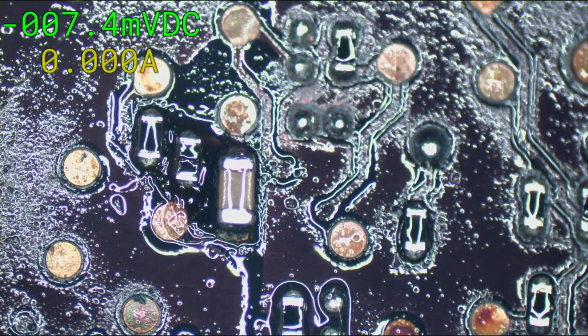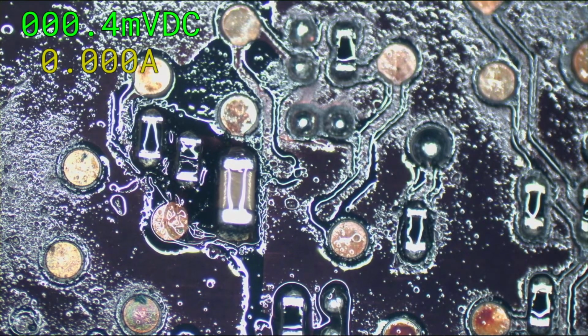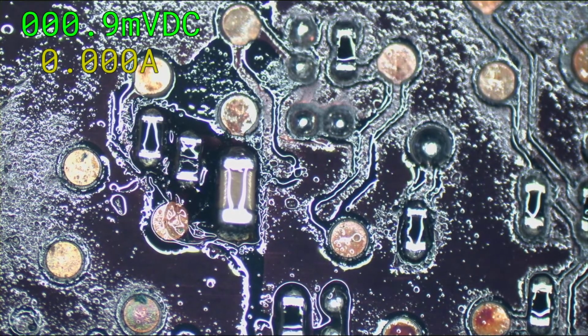That is this one. Now this is one good thing about Lewis and his flux usage. So I'm taking this off of this board. This is a donor board that I'm taking it off of. And there's so much flux on this board that this resistor that I'm taking off is dry, completely dry. But once it comes off the board, I'm going to dip it into a pool of flux that's on this board, and I will not have to dispense any new flux on my work area.